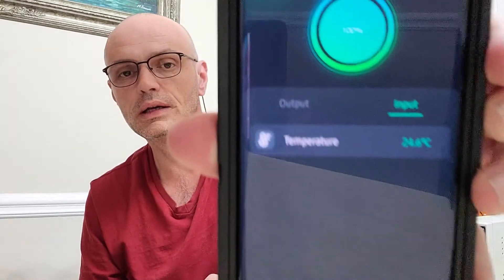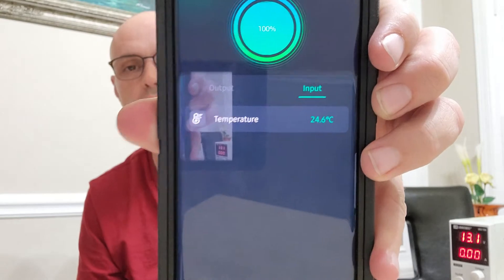Now let's see what we need to do to enable the temperature probe. We go to the menu, then 'Others' — same as the Victron SmartShunt app. Go ahead and enable the auxiliary input to read temperature. It also asks about temperature coefficient, which is exactly the same as in the Victron SmartShunt. I have a video on that too. So go back and switch the input.